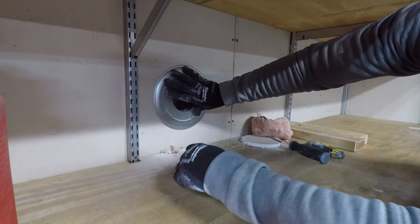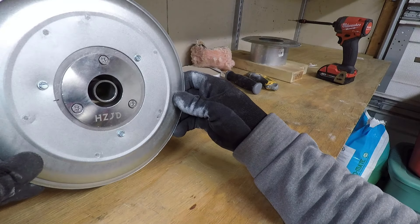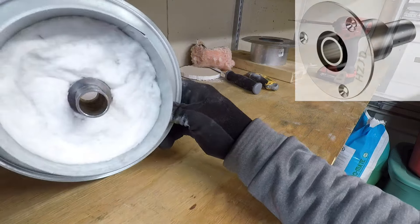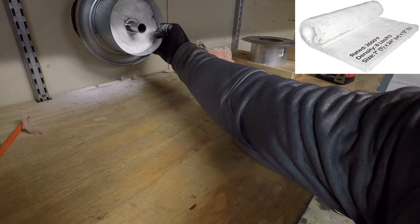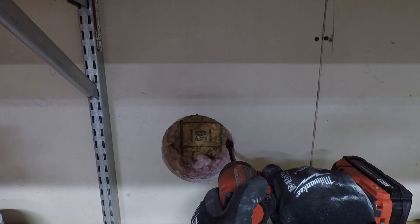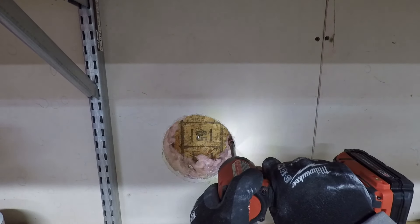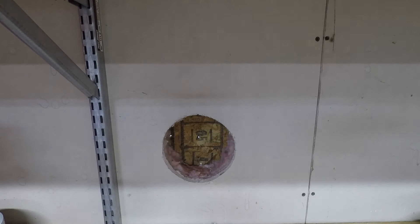What you see me doing here is putting the interior half of a flue thimble in. I ordered a through-hole exhaust adapter or port for a boat and adapted it to fit in the thimble. I used some ceramic fiber insulation to fill in the gap between that adapter and the inside of the thimble. Then I drilled a few locating holes to the outside part of the siding so when I go out and trace the thimble on the outside, I'm lined up with the inside.